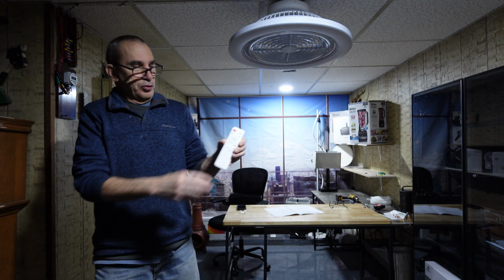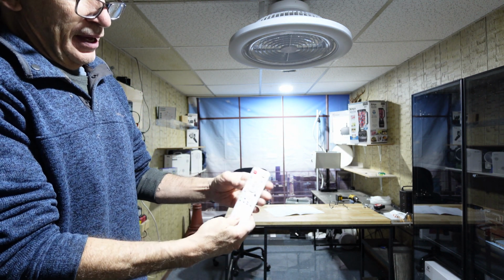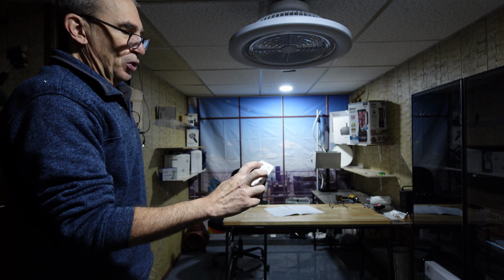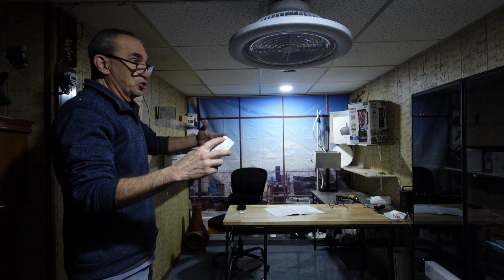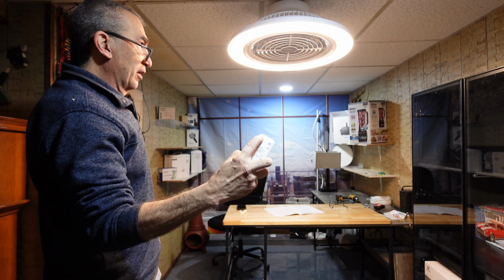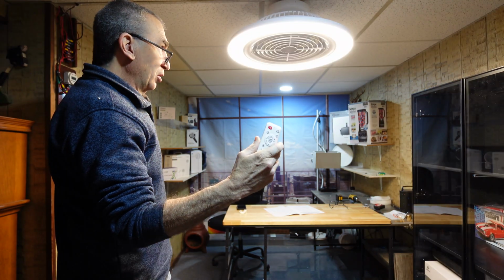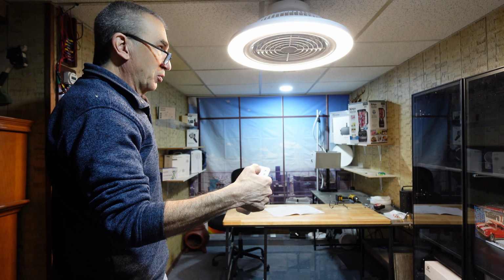This is the remote control. Supply your own AAA batteries. They go in correctly to the back. This is your on and off and pairing mode. To pair the remote control, if the unit's not turning on, what you're going to do is shut your unit off for 5 to 10 seconds, allow it to rejuvenate, turn on the unit, hold the button down until it pairs and flashes 3 times. Let go. Now we're able to shut off and turn on your remote control.